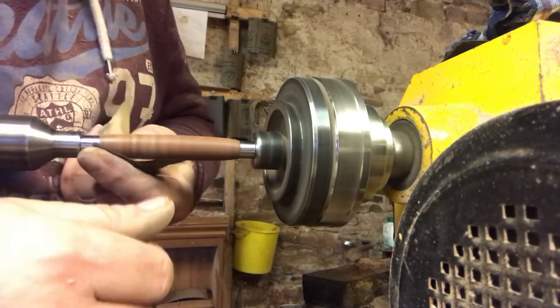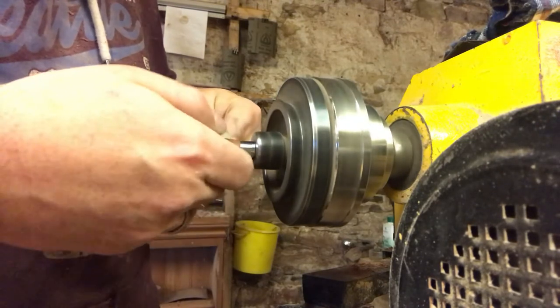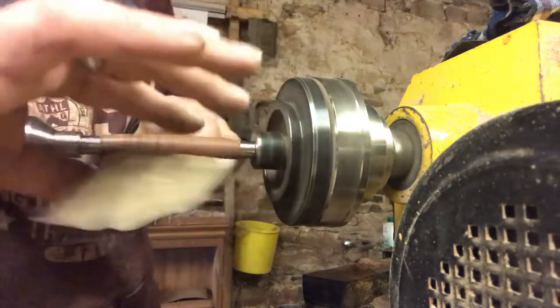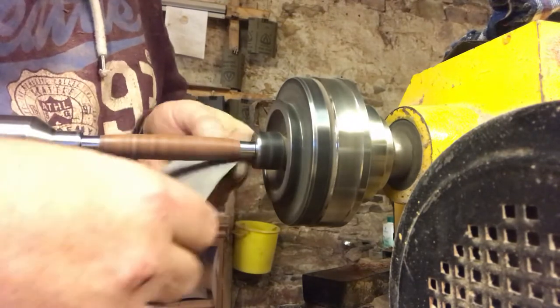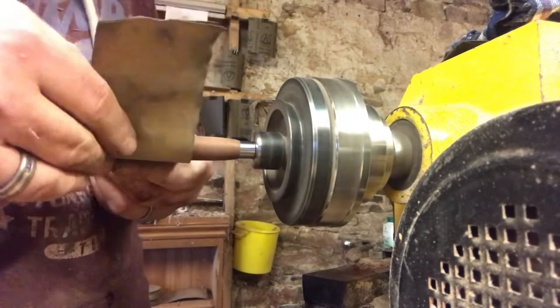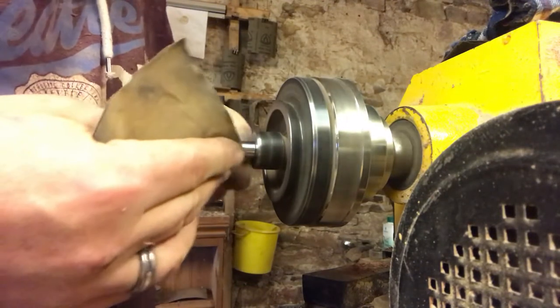Have a floor standing drill, a vise that can hold the pen blanks specifically, and then a pen mill to straighten out the ends so that you know that your bushes are going onto a perfectly flat piece of wood. Otherwise it's all the 9s and 10s and 6s and 7s, and you'll have a wonky pen.